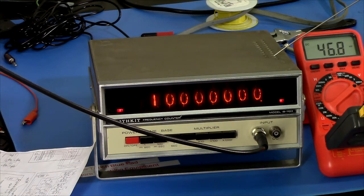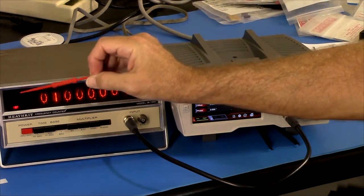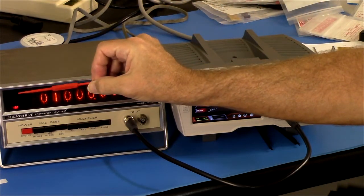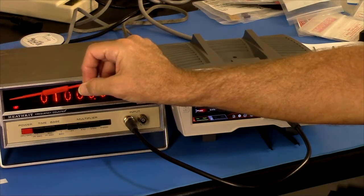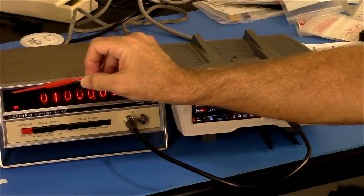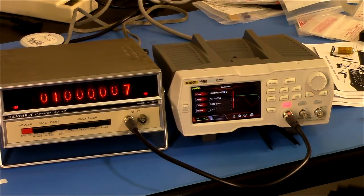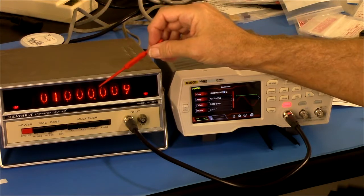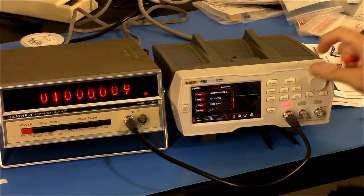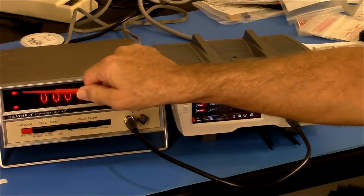But it's working. Oh, and I did add the capacitor, just a 4.7 microfarad capacitor as a low-pass filter on that lock signal. And so you see that the light, it is now locked. What am I at? 1 kilohertz, right, and times 1,000. But if I crank it up, there you see unlock is on.